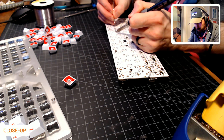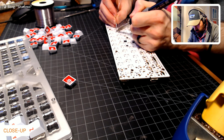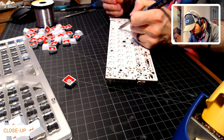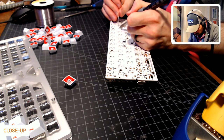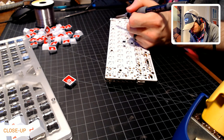And if I go back to my first board, if I were to sell it, the person who got that board would be like, what the hell happened here? What were they doing? Because I melted parts of the PCB because I held it for too long, and some of my solders have like 3 gallons of solder on them, because I wasn't adept yet with how long to hold and how much solder to feed in. I've gotten much better at that over time. It's just practice more than anything. And also having to desolder and resolder boards teaches you a little bit. Like, don't have 200 pounds of solder in each joint, because then you're going to have to get that all out when you desolder.